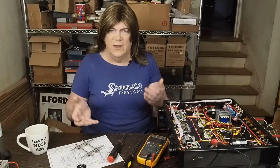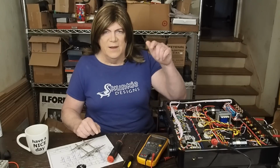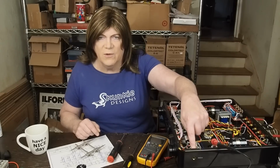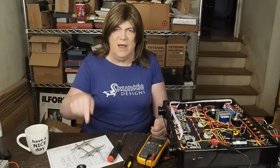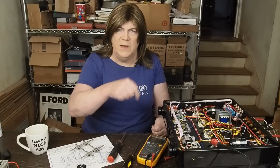I really feel that with the way this headphone jack is implemented, we've got the negative side of the speaker outputs running around from the back of the amp up to the headphone jack through some little micro contacts inside this headphone jack, and then back over and hooked to the chassis ground, which all seems crazy. I would much rather have the negative side of the output transformer going directly to the speaker terminal and then ground that speaker terminal to the chassis for safety reasons in case the output transformer shorts out.